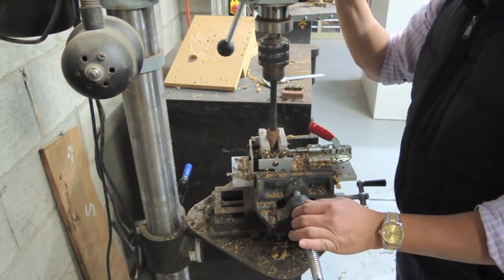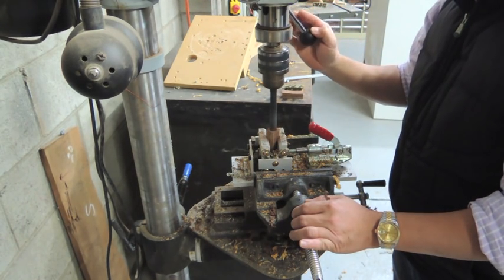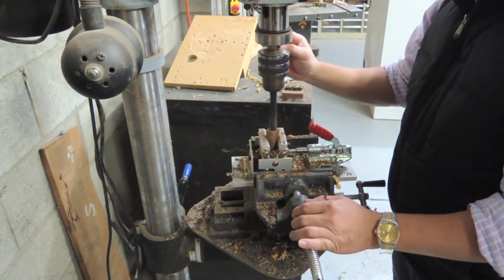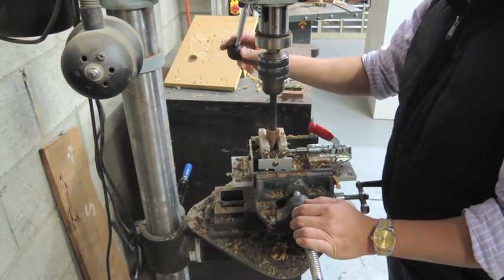The cause may be that the blank has a lot of internal stress, or the timber is green, or your drill bit is blunt, causing excess heat, making the timber distort.